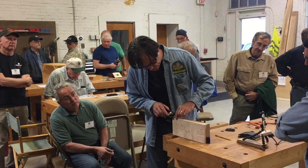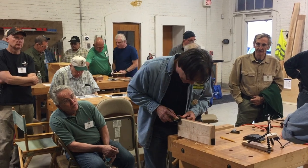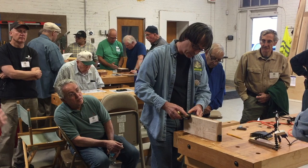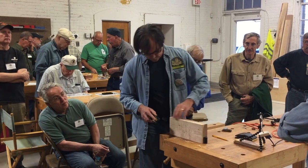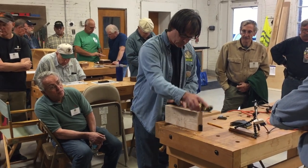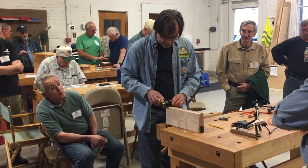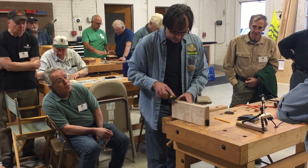In order to do a roundover, I'm just going to take off — I have one facet here at 45 degrees. I'm just going to rotate my plane to kind of split the difference between that 45 and the flat surface, so it's about 22.5 degrees. My wrist doesn't have a protractor, but I'm just going to eyeball it. I'm going to make a couple passes on this corner, and then — because this is very small and I'm cutting wood very quickly — I'm just going to move to the right-hand side of the blade and start going at different angles.